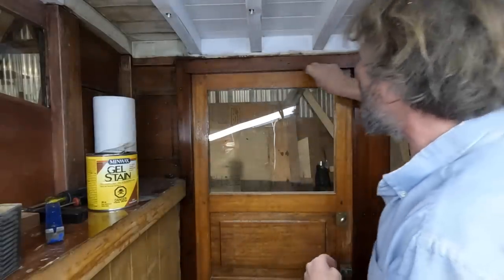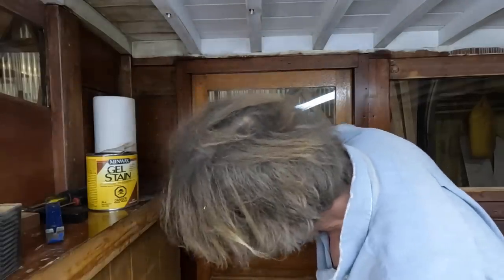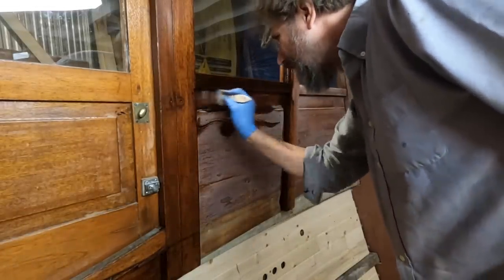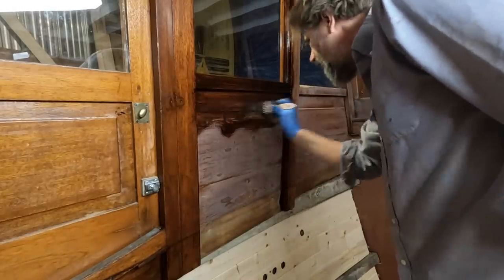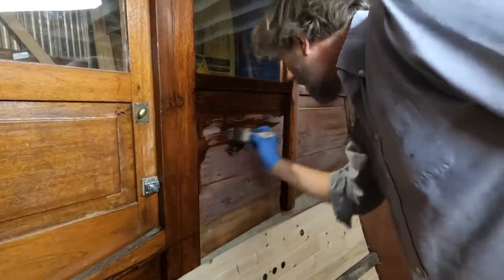Gel stain, and so easy. I left it on a bit long though. Anyway, okay, let me get busy. The instructions say 3 minutes, so you gotta work pretty quick if you wanna get a reasonable area done. I'm actually really excited about this. This is turning out to be a really successful stain.